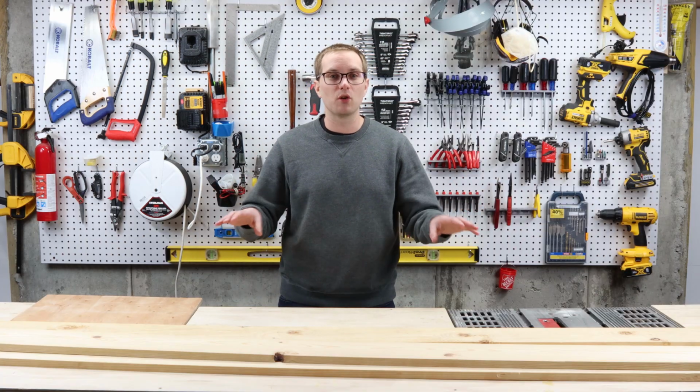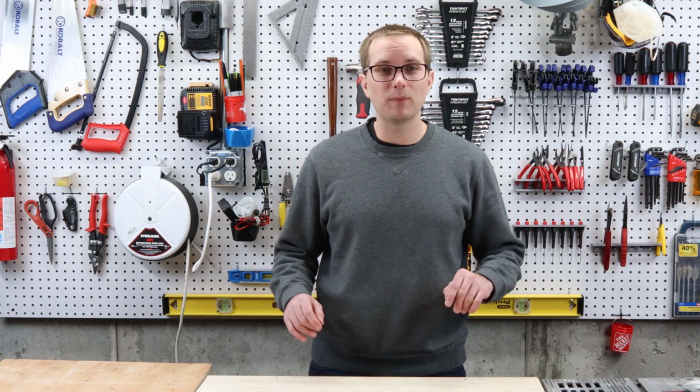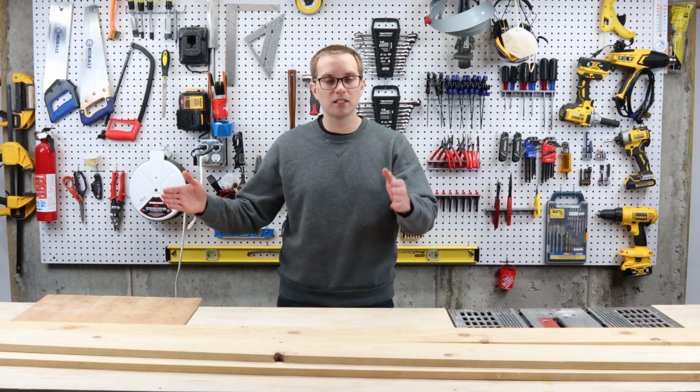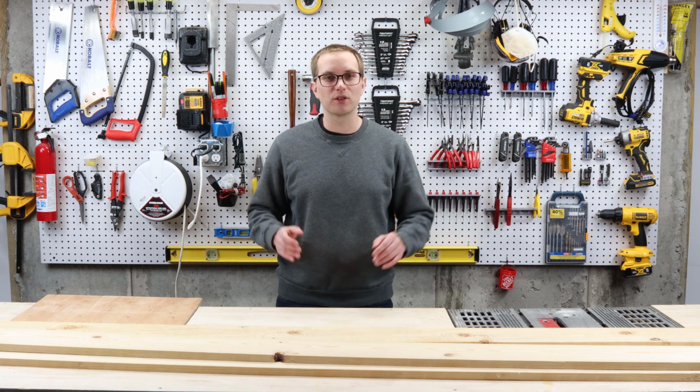Last weekend, I went to the home store to get the cedar planks, which you'll see in a moment. First step is to return this pine, go get the cedar out of my shed, and cut it down to size. After I cut it down, I'm going to glue some of the cedar boards together to make wider 1-foot boards for part of the build and 13.5-inch boards for the rest of it.